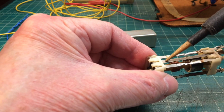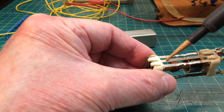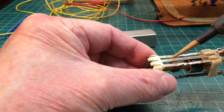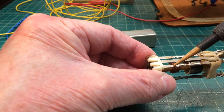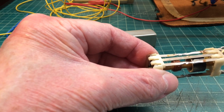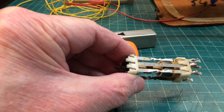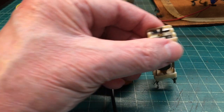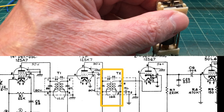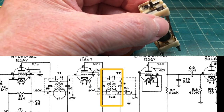For now, until I get my replacement caps — which I'll put in permanently on the bottom side, because I don't have room inside the can — I'm going to cut this center lead position and place it where I can solder it back if needed, and mount a capacitor somewhere in the value of 150 picofarads up to about 250 or so. By the way, on this particular transformer, the adjustment on the top is the secondary and the bottom is the primary adjustment.